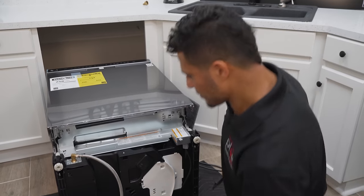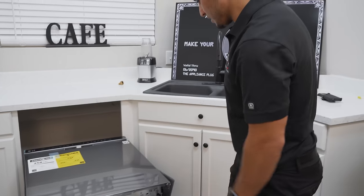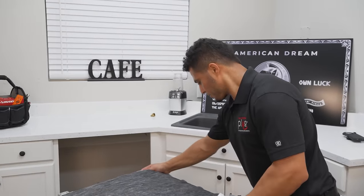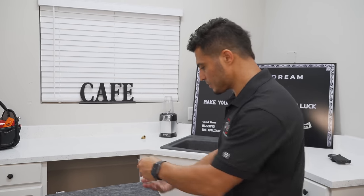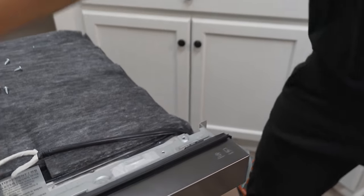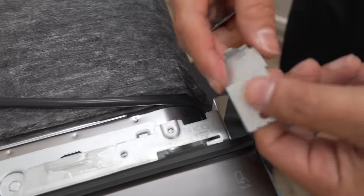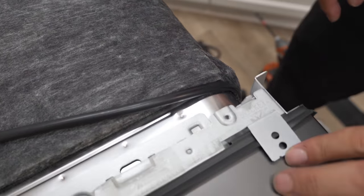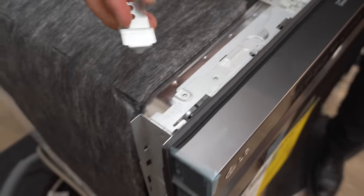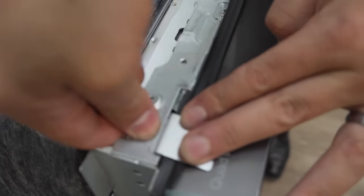The electric and water supply are ready. The feet have been prepared for adjustment and the drain hose is pre-attached. The final prep step is locating how you'll secure the dishwasher when ready to mount. We're securing ours to the bottom of our countertop, so locate the bag with your mounting brackets. Each bracket is labeled on the frame on each side — it simply goes in at an angle, flips around, and that little tab bends in to hold it in place. Repeat on both sides and it's ready to go.